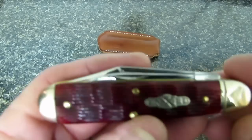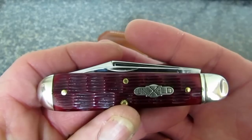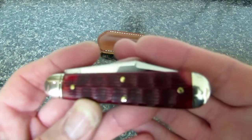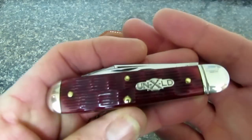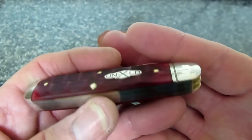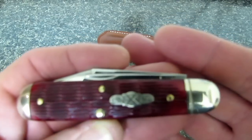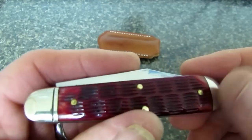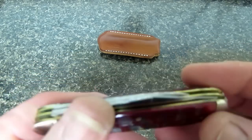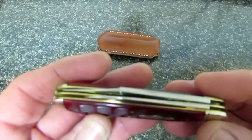And it was used in counterfeit coins back in the day. And when the jig was up on that program, when the authorities figured out how to easily test for it, this German silver or nickel silver found its way into, among other things, the knife making industry as an alternative to brass, which does haze and corrode, sort of gets that dull yellow cast to it. Nickel silver doesn't do that, although it will scratch and haze over as you get pocket wear on it. It polishes up easily and it doesn't tarnish at all, which makes it a very nice material for bolsters on a knife.